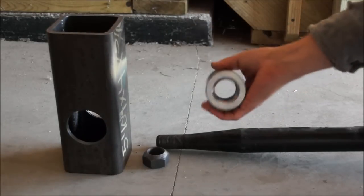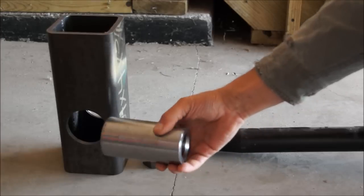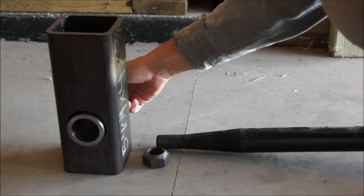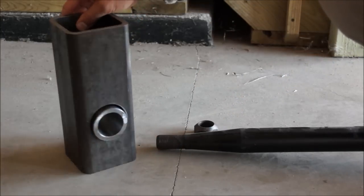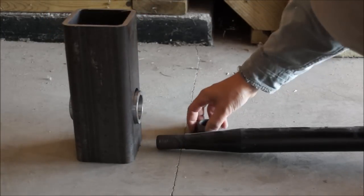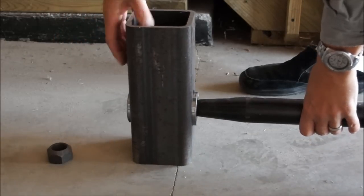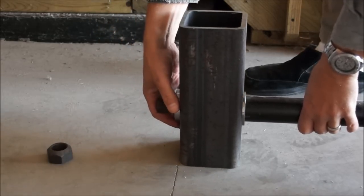As you can see here, it's got kind of a thick side and a thin side, so it fits the bale spear perfect. Again, this was all purchased. We're going to stick it in our piece of 4x4 metal, line this up in the pallet fork, and put it in the center of the pallet fork. And then we will be able to put the bale spear in it and tighten it down with a nut